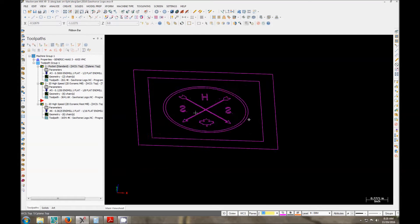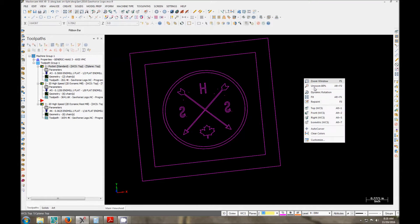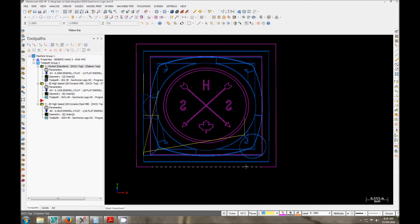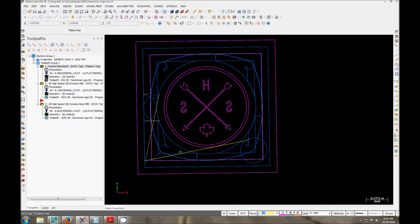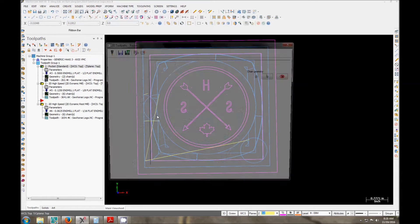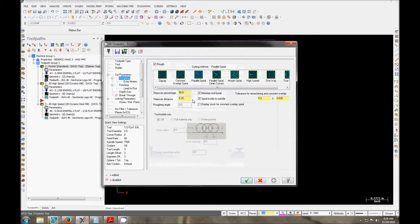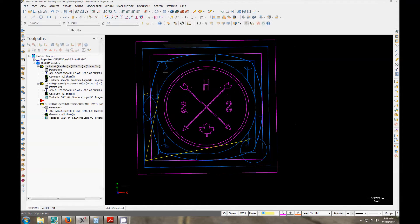I didn't do any 3D modeling — it's all flat geometry, so it's pretty easy that way. Our first tool path is a pocket with a half inch cutter. This goes around the outside. You can see it has a helical entry here. It's going down to 1/8" depth, just cleaning out everything along the way. I believe I'm using a parallel spiral tool path on this, and you can see that's why it has these little ins and outs in the corners to clean it up.